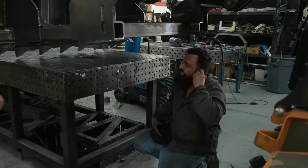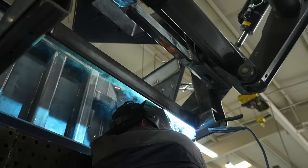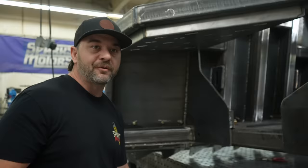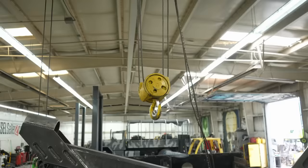That'll improve your hearing. So when Pedro put this together the first time, the mounting brackets were just tacked into place because we didn't know what winch we were going to be working with. Now that we have the winch here, he knows where the holes are going to be and how far apart the mounting brackets will be. As you can see, this whole thing bolts into place. Once he gets this welded, we'll be able to drop the bottom out of it, mount the winch to it, and then sandwich it back together in the winch box. And we've got ourselves a mounted winch, and then we can move on to the next step. I think pulling it apart again, painting it, fitting all the angles and everything for the winch to actually function. A lot still has to go into this, but we're test fitting the actual winch itself today.